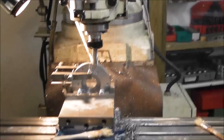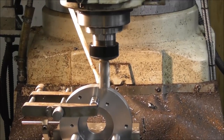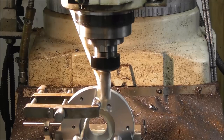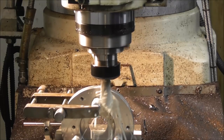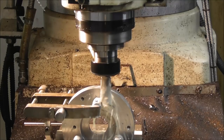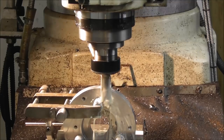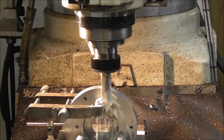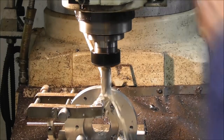So the 3/4 inch cutter is 4.2mm back off the face, and I'll just take you through this for a second. So I'm going to use the quill so that I'm not highly stressing the cutting action. Zero it up on there. I give it 1mm cuts. One millimeter. 5.2. So we're now 5.2 away from that face, a 1 millimeter slot.